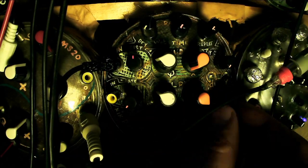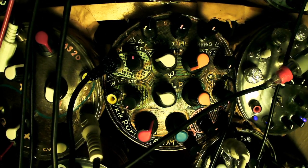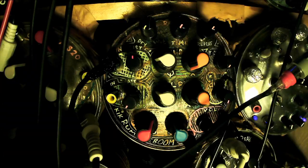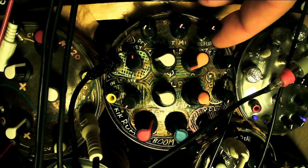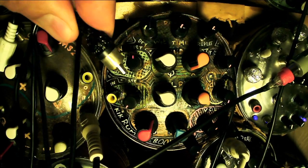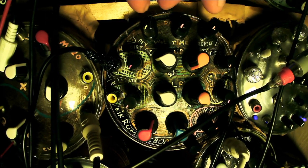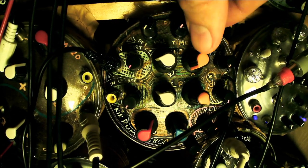Okay, this is what this can do. Let me first make sure it's plugged in — it is plugged in. These three knobs control a basic PT2399 delay circuit. Then it goes to this knob, which is a reverb. Oh my word, you can't see anything. There's a light right here that lights when the reverb input is clipping. The drum sound goes into this wire right here, and this is a ProcoRat distortion module. So ProcoRat, PT2399, with dry-wet, times of repeat, and numbers of repeats.